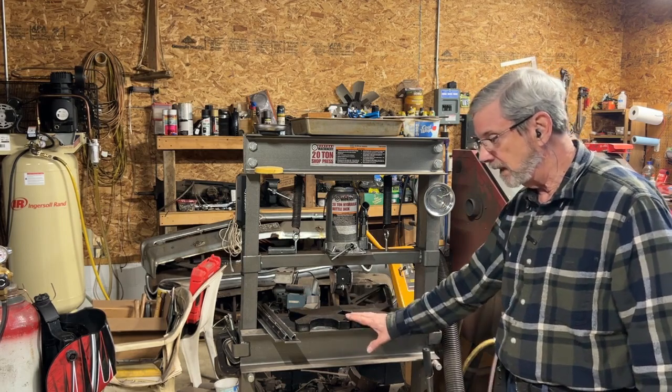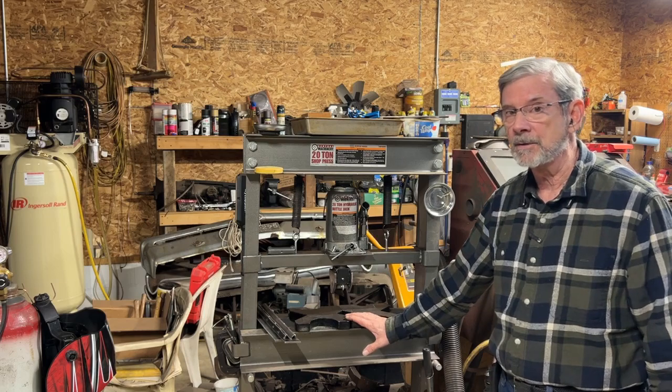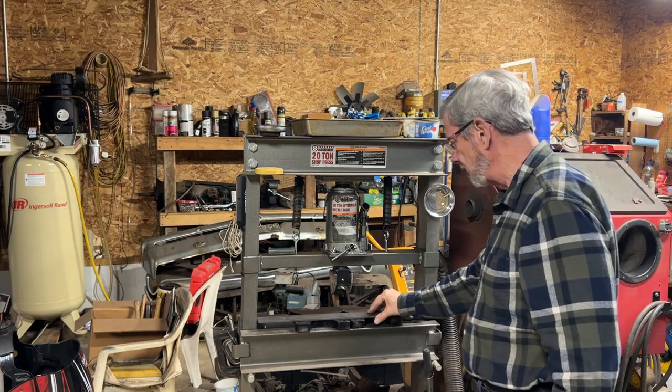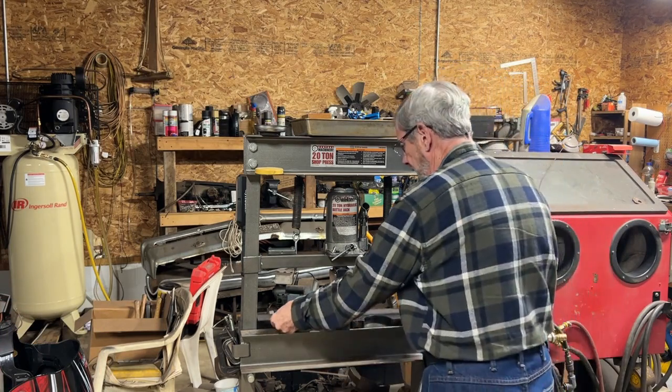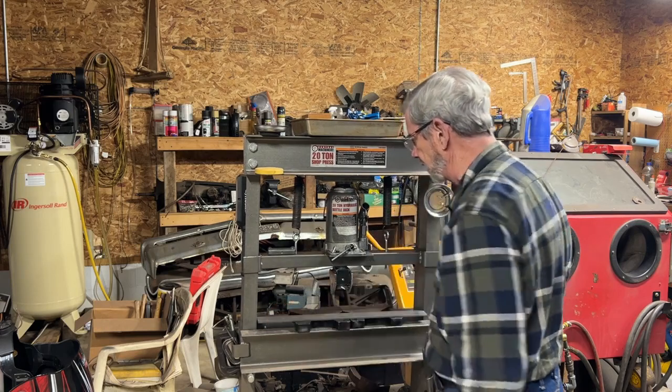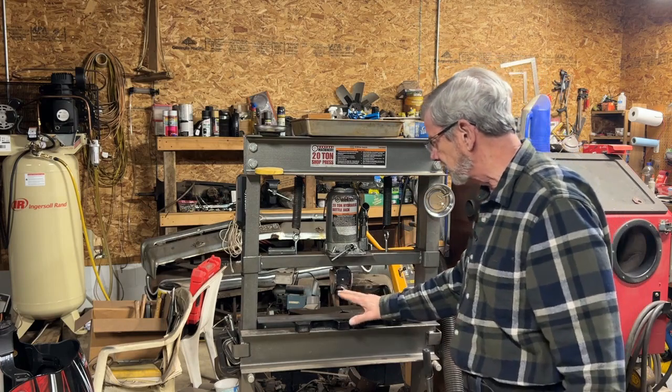And I'm not going to show you my cutting and welding, but I will show you the results and why I'm doing it the way I'm doing it. All right, I have my base plate cut, and I want it to just barely fit in there, just a little bit of clearance. I was shooting for an 1/8. There's probably about a 1/16 inch in clearance.